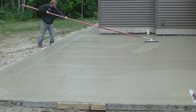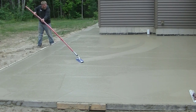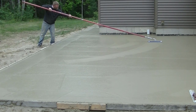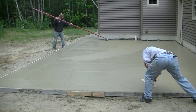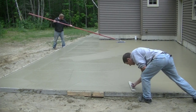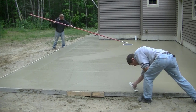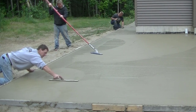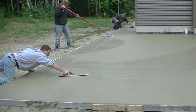Hey everybody, Mike here. In this video, we're pouring a colored concrete patio and we're going to stamp it, Ashlar Slate. So you're going to get to see the stamping process. Right now what Darren's doing is he's mag floating the surface. We're getting out all the bull float lines. We're basically just preparing the surface for the stamping. This is what we do. We'll mag float it, get it nice and smooth, and then we can start dusting this thing.